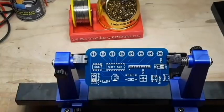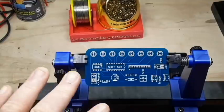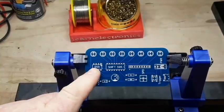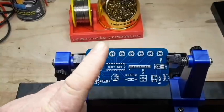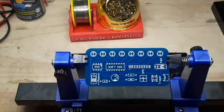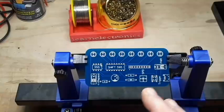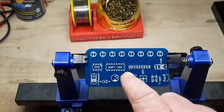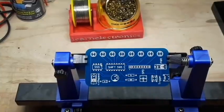We're going to take a look at another board from Keith Lohmeyer today. This one is an interesting little circuit design using a 555 timer and a 595 shift register. The way this circuit works, you press the button, the 555 timer is going to pulse the shift register and it's going to light up the LEDs.